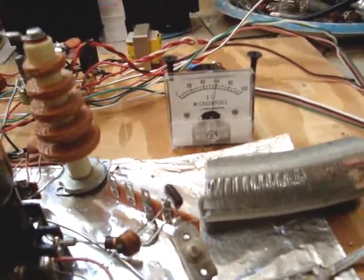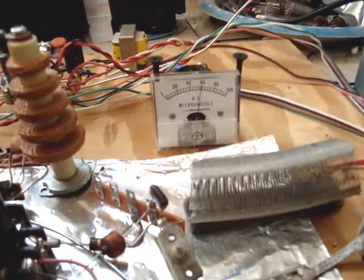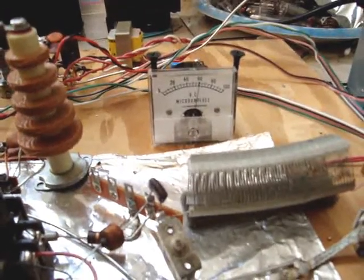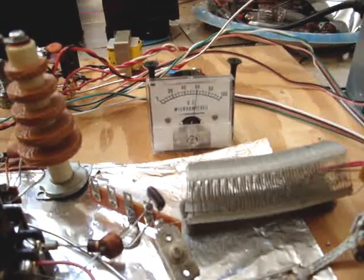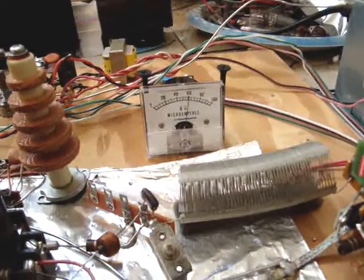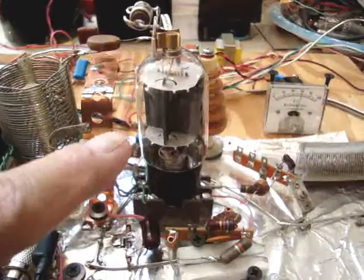I can dip the plate. So I can dip it. There's one side — there's the other side of the dip. I dip it for efficiency: you dip it all the way down and then bring it up a few milliamps or so. I checked the efficiency on this — it's like seventy-two percent plate efficiency on this tube. Four hundred twenty-eight plate volts, sixty-one milliamps — that's no modulation.